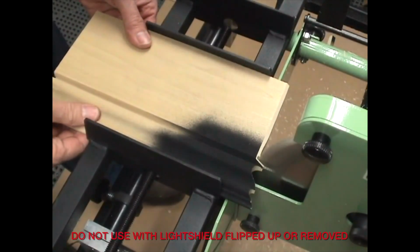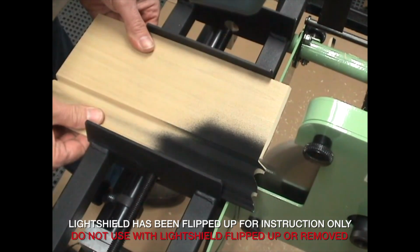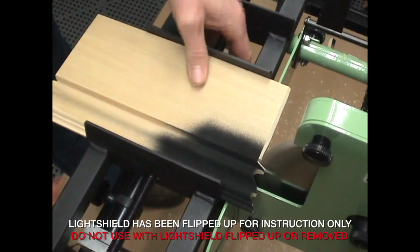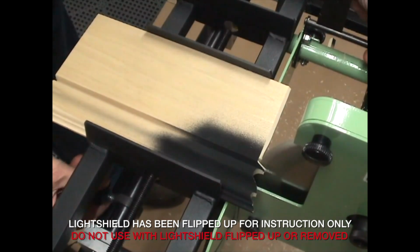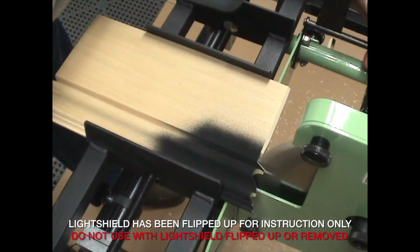To finish the straight cut, move the blade close to the straight edge and lock both carriage locks in place. Loosen the vise and move the wood into the blade right up to the black line, and lock the vise. Unlock the front carriage lock and move the blade side to side to finish the straight cut on your baseboard.